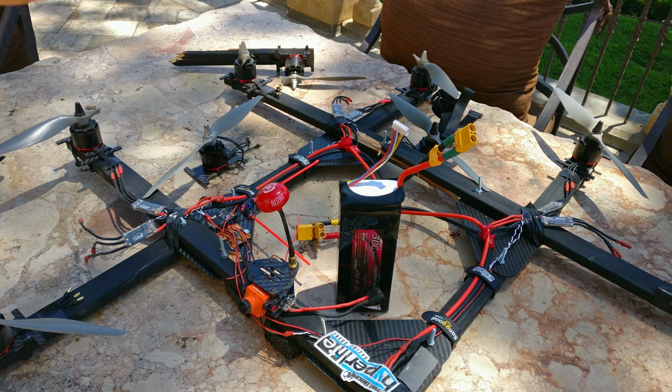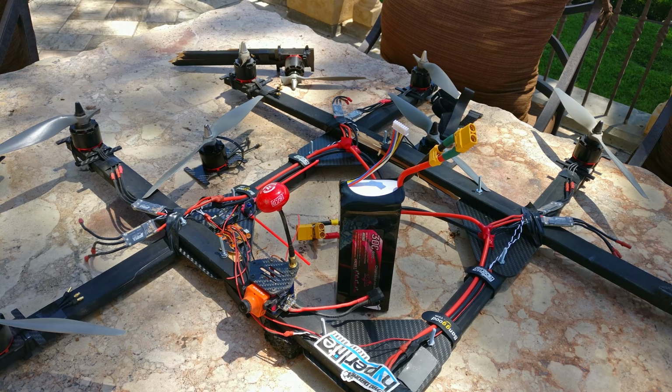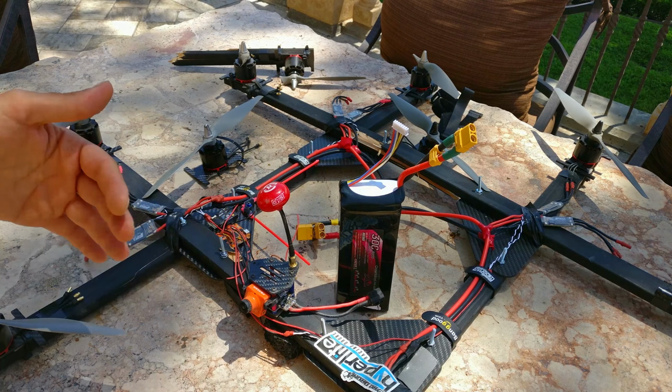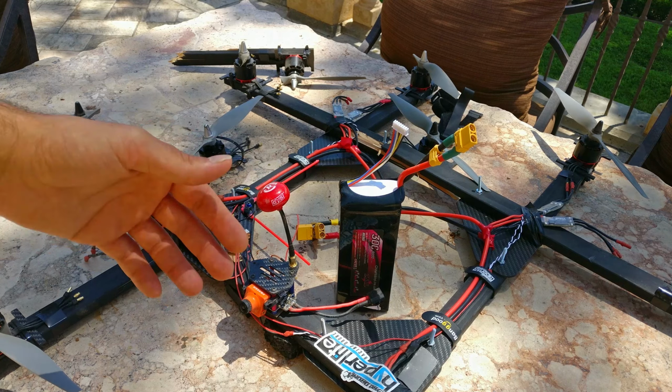Having 8 blades, the reason I chose to have an octo is because it's supposed to be a 1 meter class craft, and it's kind of dumb to have a 1 meter size craft that has tiny little props at the end of long arms. So I chose to go with an octo because it would be purposefully 1 meter large. It has to be 1 meter large to fit these 12-13 inch props.